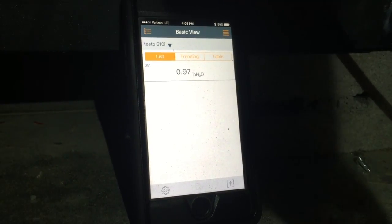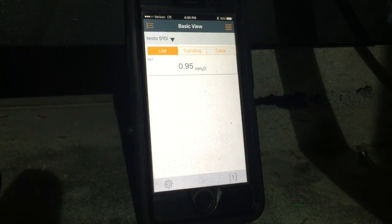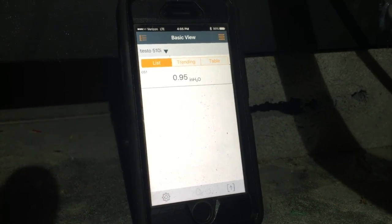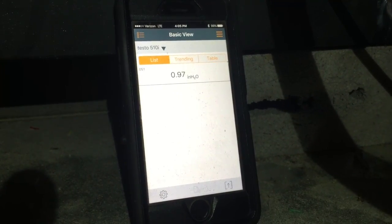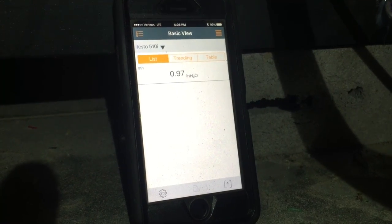So I still haven't blown the fuse again, but I think my recommendation is going to be to isolate the zone board power from the power of the thermostat or the system, so that we've got a separate transformer feeding the zone board.